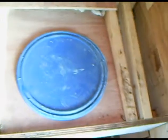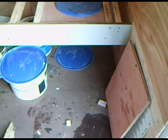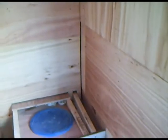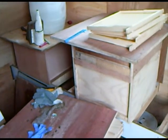So we've got cold air from below the shed coming into here, and then I'm going to have a vent up against the wall to get some airflow going round. The hole through the floor is going to have six mil mesh over it to keep rats and mice out. The air from below the shed is going to be a lot colder and the air at the top of the shed will be hotter — cold air in, hot air out. If that doesn't work, I'm going to buy one of those solar-powered fans they have on canal boats and use that.